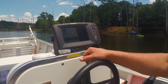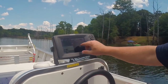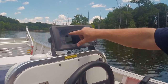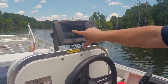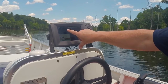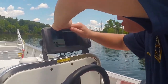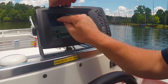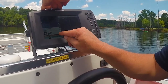The next page gives you three screens: side scan, your depth here, and again your depth up here. This one is what we'll most likely use to find an object such as a vehicle or a drone, because it can pick up the density of it. This one here can also pick up density but it's a lot harder to read. You can see those little lines clustering up there — more defined up here, more of a cluster down here. Another one coming in you can see on the bottom, but down here you don't see anything. So this one down here is more refined for the density of an object.